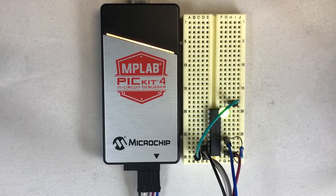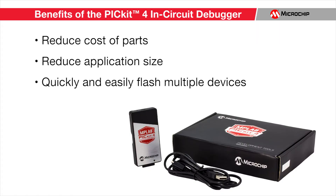This tutorial gave a quick introduction as to how to flash a PIC microcontroller using the PIC Kit 4. With this device, it is no longer necessary to buy full development boards with onboard programmers. This can greatly reduce the cost of each part that you buy, and additionally reduce the amount of space that your application occupies. The PIC Kit 4 makes flashing microcontrollers easy with very few connections. This is great for situations in which multiple devices need updates. If your circuitry is configured so that the connections to the PIC Kit 4 are easily attachable, you can very quickly reflash each of your target devices.